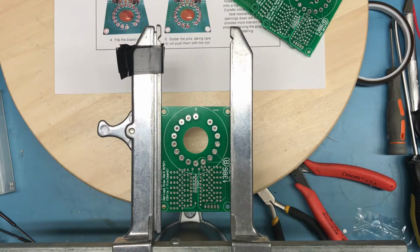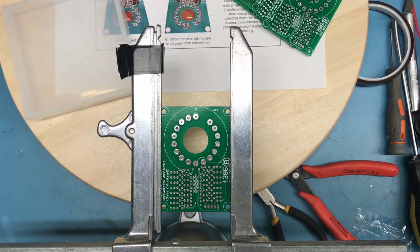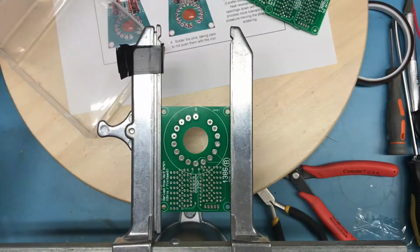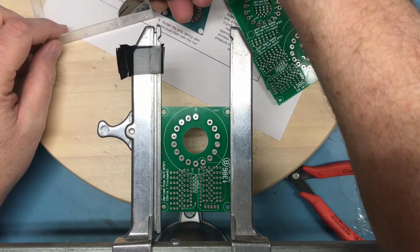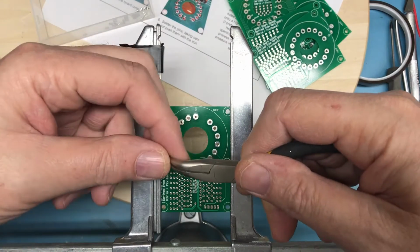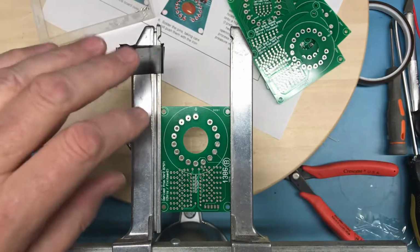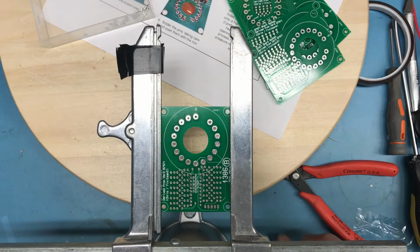There's a note someplace in the instructions that talks about when you drop the pins into the holes, they tend to self-center. And that's correct. I can feel them kind of self-center when they drop down in. So I've got the board held pretty stationary here in a clamp. I've got a little box here full of the pins. Of course, I'm working around cameras and mounts and everything here. And all I'm doing is picking these up one pin at a time and just dropping them down into the little hole. And they drop down in pretty well and seem to self-center.